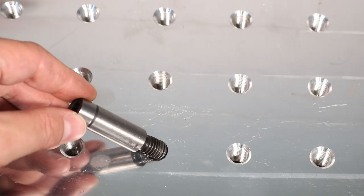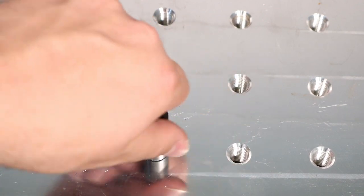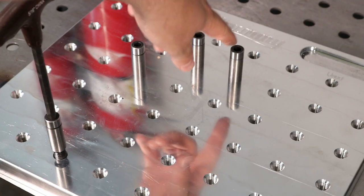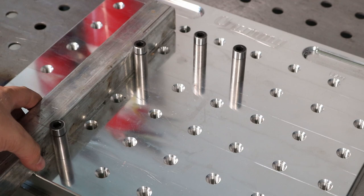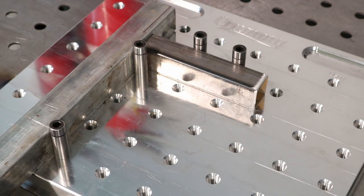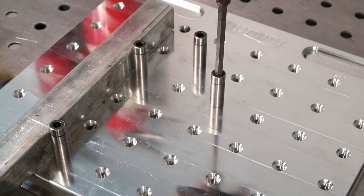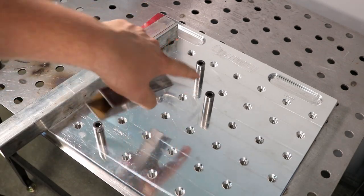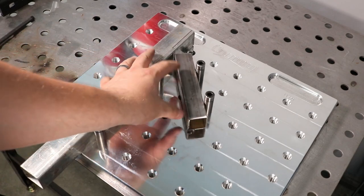You can just thread these pins right into the holes. I left the top exposed so you can still use an Allen wrench on them to make good little stops. Using a combination of four of them threaded into the plate, I have a perfect right angle just going off the index of the fixture plate. If I move one down, I can line things up at 45 degrees — it's a pretty simple arrangement.